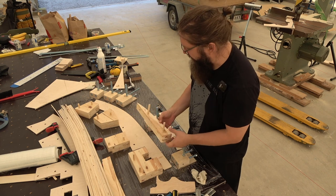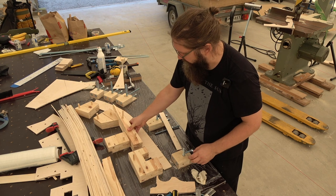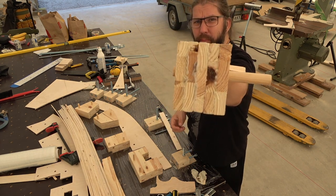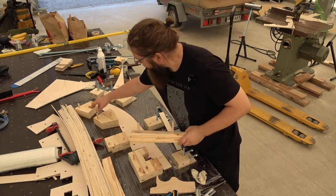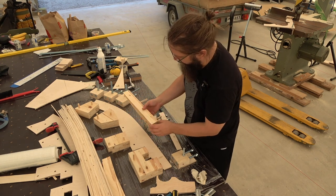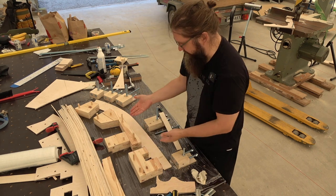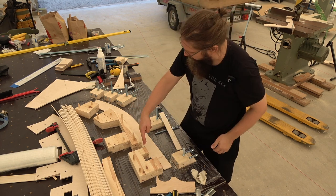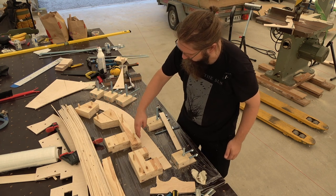Alright, now it has been taken apart and here you can see the filler piece on the inside. This will be part of the lamination. This is just a few of these pieces I made for the clamping guides. There's a couple of dowels here just to fit it perfectly in its place, and it also helps it to be still when I'm pressing it down so it won't move this way either. So it will create this curve right here that the slats will laminate with.